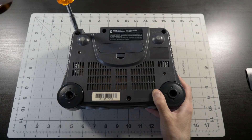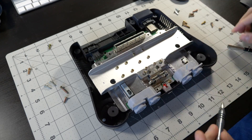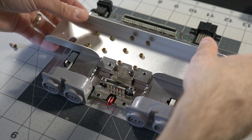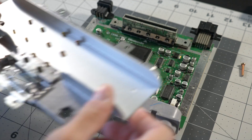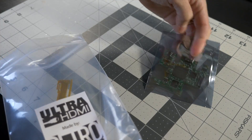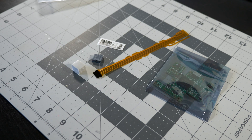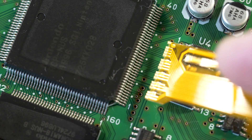Let's get the kit installed. I started by disassembling the N64 and removing the motherboard, then pulling off the heatsink assembly. If your console's dirty, now's a great time to clean it up. I decided to do the hardest part of the install first: soldering the FlatFlex ribbon cable to the motherboard. Most of the pads connect to the N64's Reality Co-Processor, or RCP.